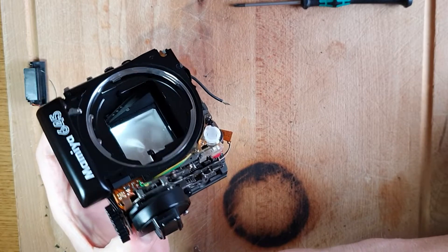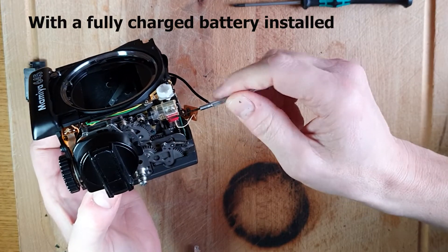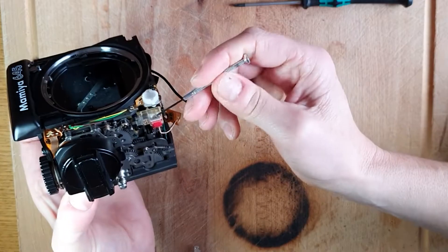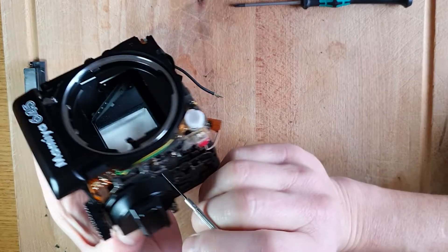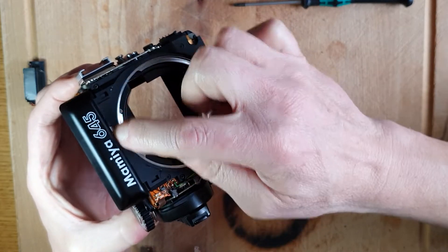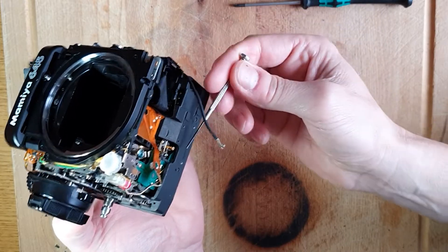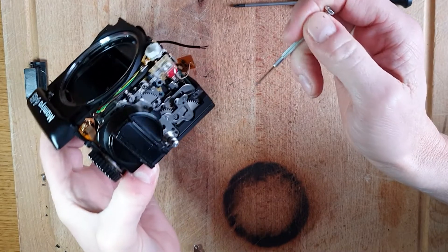You may find that your camera is quite happy to open the shutter when you press the shutter release button. This would indicate that this solenoid — or electromagnet — is working. The process goes like this: when the battery is installed, you press the shutter release button, it energizes this electromagnet, which opens the shutter curtain and brings the mirror up. The exposure time is dependent on the position of this variable resistor, coupled to your lens and shutter speed. After the exposure time, a second pulse arrives at a solenoid just underneath this plate, which pushes the white pin across and finishes the cycle of closing the shutter and bringing the mirror back down simultaneously.